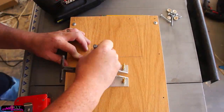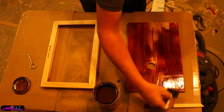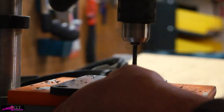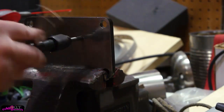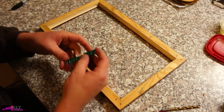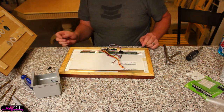I mark up where I want the controller board and drill holes for its mounting bolts, again using a Forstner bit to make room for the head of the mounting bolt in the strip of wood. I use some spacers to hold the board off the back panel and drill a hole for the cables to go through. I decided to stain the frame with a mahogany red and some clear coat. For the stand, I use an approximately four-by-six-inch plate of steel that's a quarter-inch thick — it weighs nearly as much as the rest of the project, making for a great sturdy stand. Two holes are drilled for the hinge to bolt to, and a third is drilled in between and threaded using an SAE quarter-inch by 20 tap — the same thread as the tripod mount on the bottom of cameras. After painting the stand, I begin final assembly: remounting the controller board, installing the buttons, dropping the protective plexiglass and screen into the frame, and reassembling and mounting the stand. I stick clear pads on the underside of the stand to protect any surface it sits on, then plug the cables from the controller board into the back of the screen and buttons, and close it up.